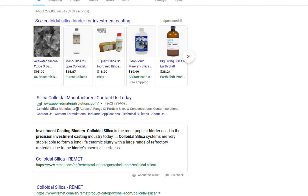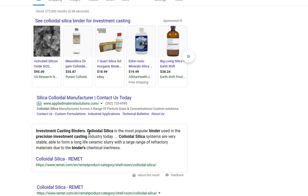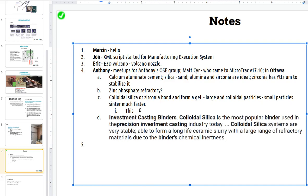Yeah, that's a possibility, to just basically try to clone the conventional industrial investment casting process on a small scale. It's an interesting idea. Well, if you've got this binder, so what are you binding with the binder? Is it sand? Yeah, it'd be refined sand. You'd want a little bit of refinement to it, like get rid of some of the impurities and stuff. But that's basically it. Usually it's silica, so it would be sand. But sometimes you use zirconia or even graphite.